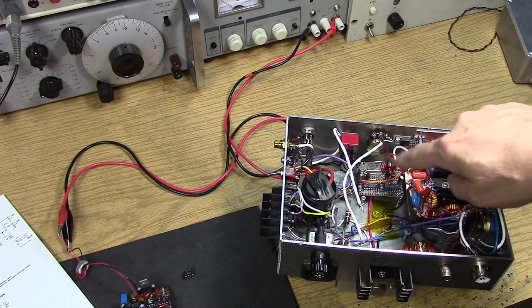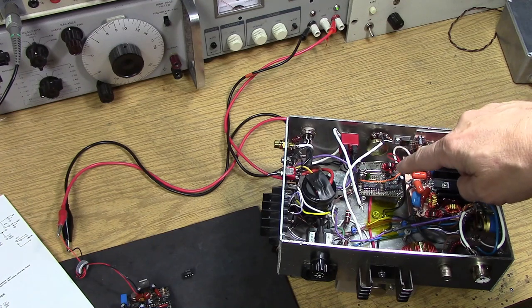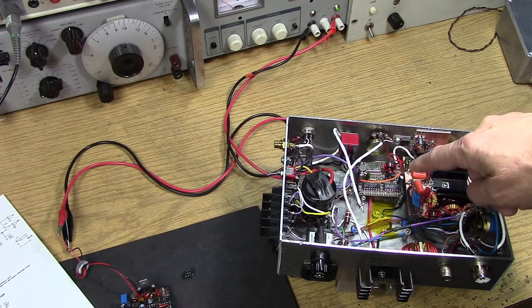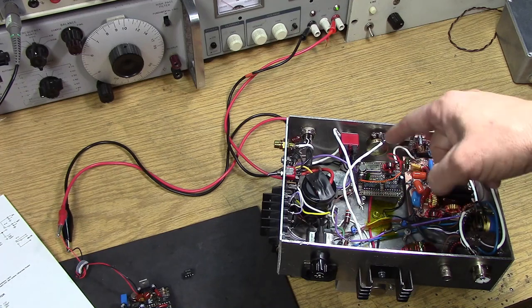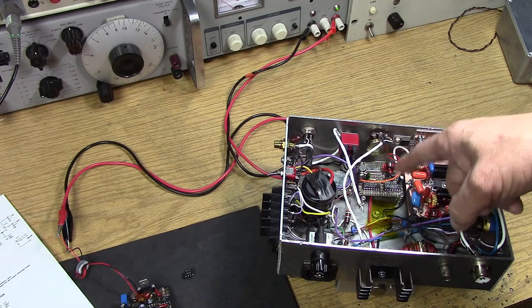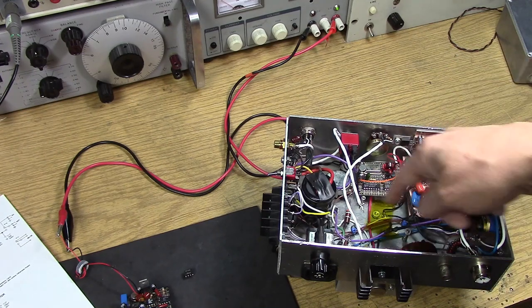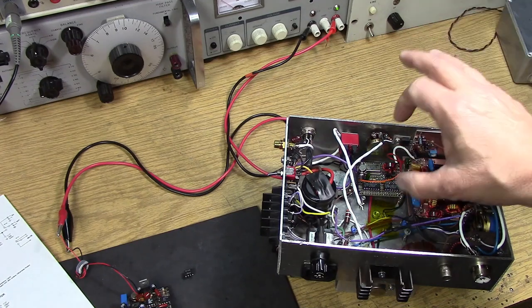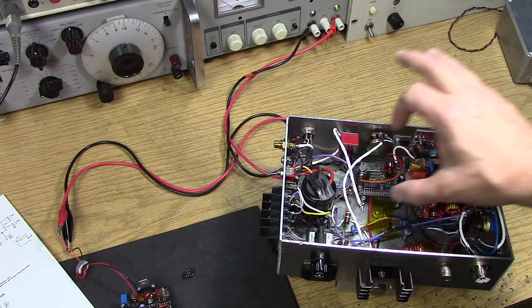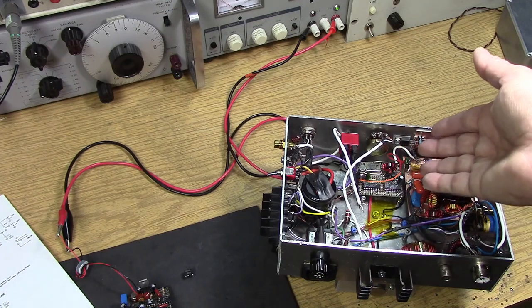And I've got the original RF system on one little board inside the transmitter. This is the one that uses the 31 megahertz clock, and I divide it down with three flip-flops to 3875. So there's one section of one of the flip-flops I'm not using. But anyway, that still works perfectly, and that's on its own. No sense in dragging that in and out because it's a working circuit.